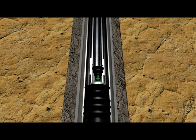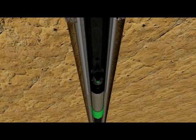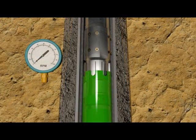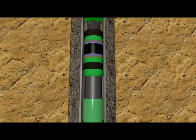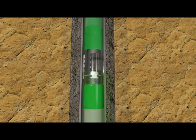The pump-down plug will latch into the liner wiper plug. Pressure is increased from surface to shear pins, allowing the liner wiper plug to be displaced downhole. Together they create a barrier between the displacement fluid and cement, wiping the liner clean and keeping the cement from being contaminated. The HRTE tool allows rotation of the string for better cementing. During rotation, the liner hanger remains static at its position while the upper drill pipe string and lower liner string can be rotated at 15 to 20 RPM. A unique taper roller bearing is used in the running tool to bear a greater length of liners.